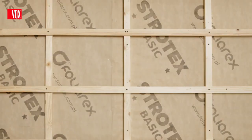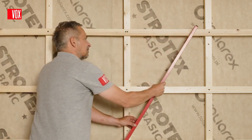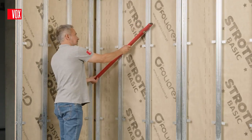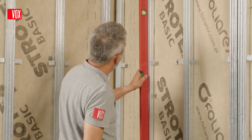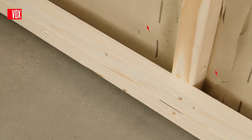The first step in facade installation is the preparation of the substructure. This is a labor-intensive operation that takes up to 70 to 80% of the total installation. However, a correctly executed substructure guarantees the correct completion of the facade and an excellent end result. The substructure also allows for adequate air circulation between the wall and the facade.